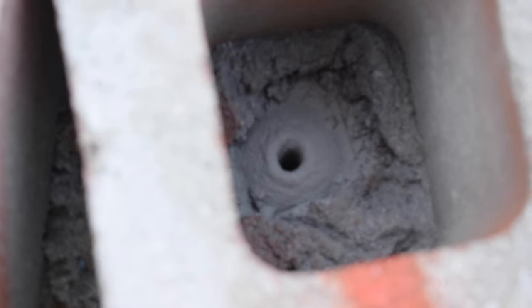Okay guys, we just finished drilling our extra holes into the foundation. That's what they look like right here. They're like giant anthills. And I'm going to go and grab the angle grinder real quick, because next we have to cut up some pieces of rebar into 16-inch pieces.